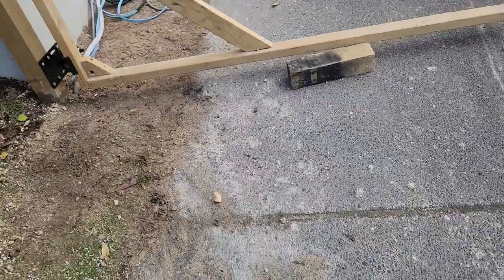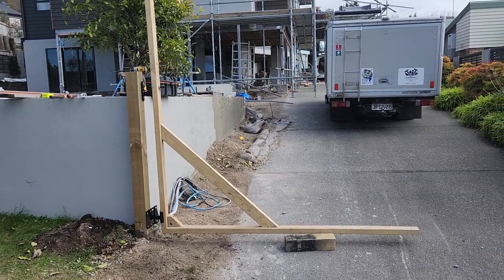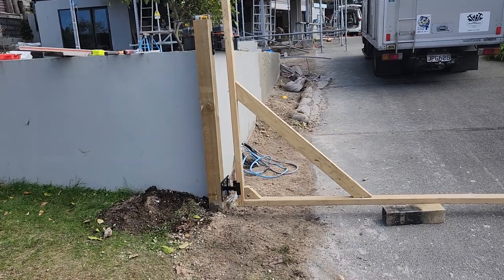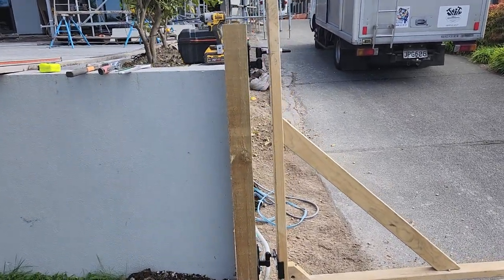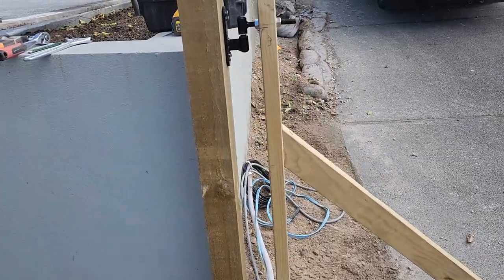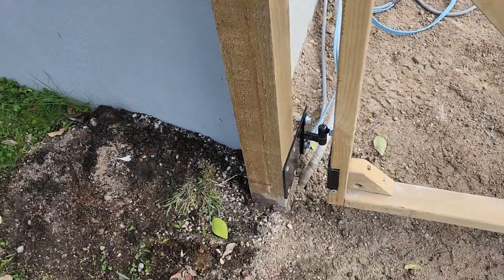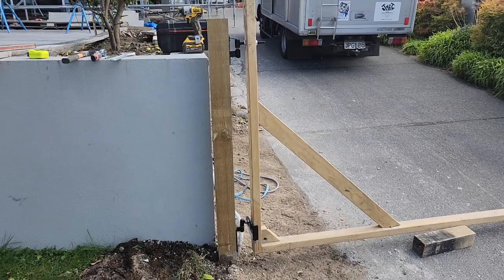What I've done is created just a timber frame which has a 90 degree, and I've set this timber post — it's a temporary post, a steel post is going in here later. I've just set up a timber post because with timber you can just screw bugles in and temporarily attach things instead of making the whole thing out of steel.